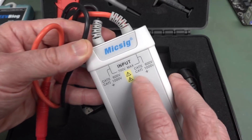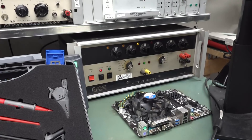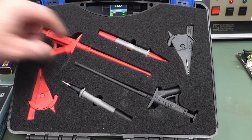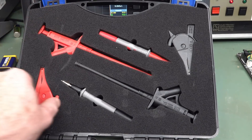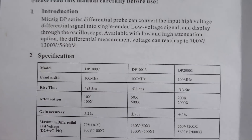So people wanted to know what's the actual voltage rating of this thing, and that's what this video is about. I thought I'd actually test it, because I have my high voltage AC standard here which can go up to a thousand volts AC only at around one kilohertz. This will allow us to input up to a thousand volts RMS into this and see where this sucker clips. Let's go. Oh, by the way, it does come with all the accessories — they are very large though, like really high voltage stuff, not very useful for getting in there on PCBs. And the giant crocodile clips — look at that, it's enormous.